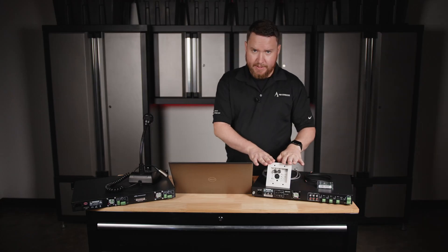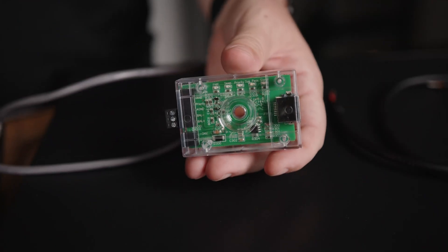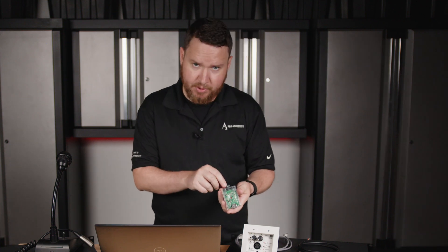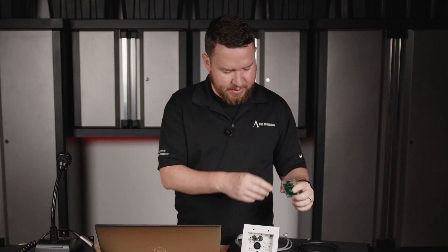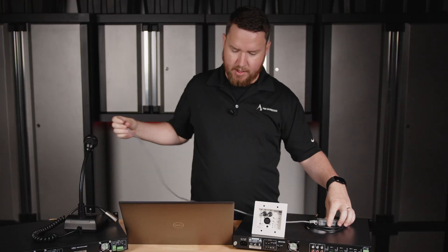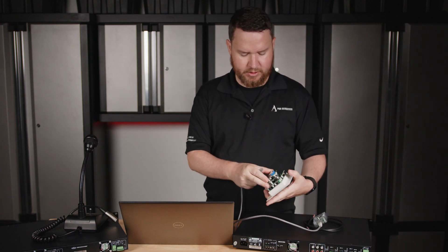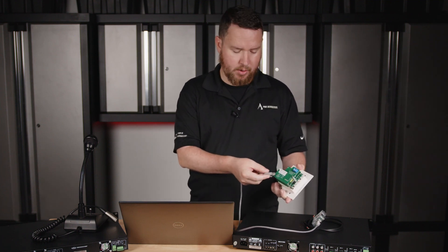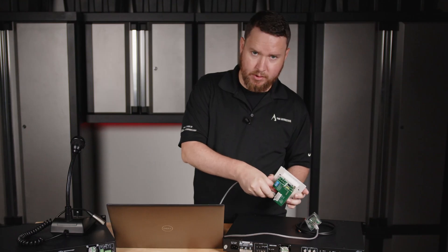When you buy this mixer, it comes with at least two parts. The other part is the BOB — the breakout box. The breakout box has a series of connectors corresponding to their various purposes, and this is also where the power supply connects. You plug the power supply into this device, then connect your network cable into this box, and from there wire it a few hundred feet away over to your WTSD, which has a connection to pass through to another unit or go back to your breakout box. You make that simple connection inside your wall inside your dual-gang box.